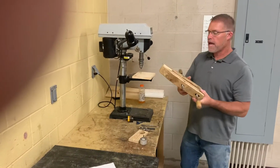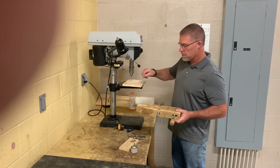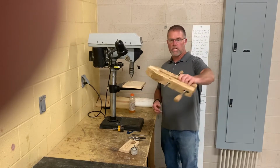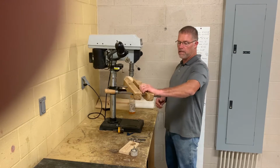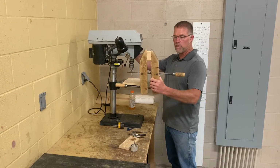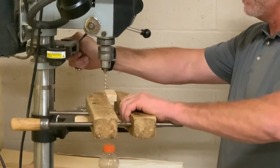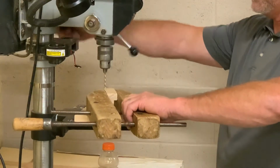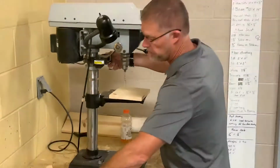Now, I'm not asking you to clamp the wood to the table, because that's hard to do, it's too small. I'm asking you to put the wood in a clamp. Now I can hang on, I have something to hang on to. I made that little piece of wood big, and it's not gonna spin. It's way too heavy to spin, and I can drill that now. If it catches, it's just gonna stop until I lift up. Okay, so much easier.